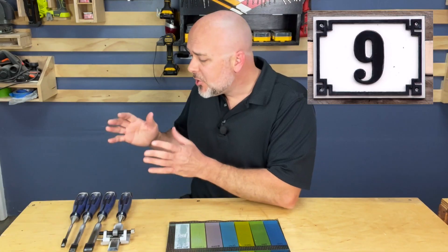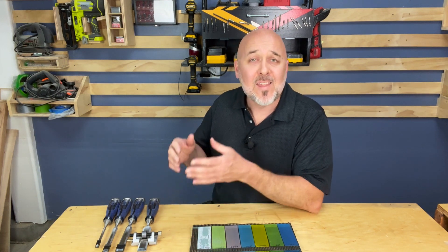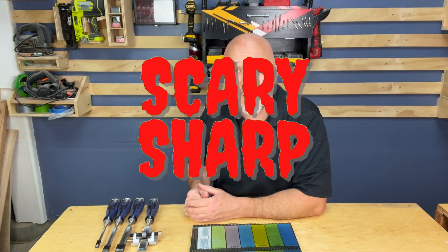Don't number 9: Don't bother owning a chisel set if you have no way to sharpen them. When I bought my first chisel set, I was totally unprepared — there's no substitution for preparedness. I used them over and over and they became more and more dull. Find something that works for you — be it the whetstone, diamond stone, or even the scary sharp sharpening system like I have here. Check out my video on how 25 bucks can get all your chisels sharpened. Have a sharpening system ready and be kind to your chisels.